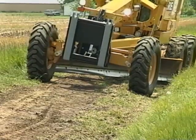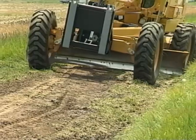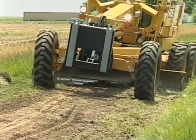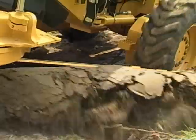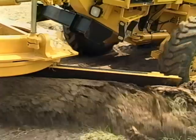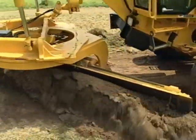After you pull the ditch, position the grader, set the heel at the bottom of the ditch and the toe of the blade on the back slope. And again, use a blade angle of about 45 degrees. In back sloping, you're interested in reshaping the slope. It requires a tight blade, pitched upright or slightly back.